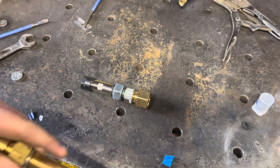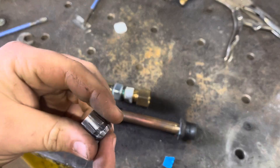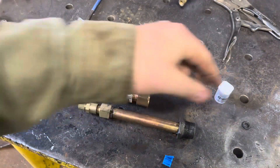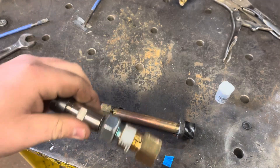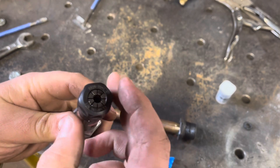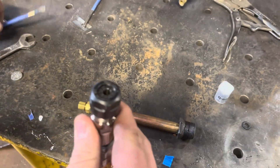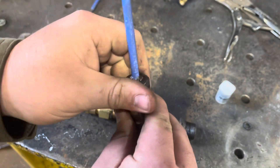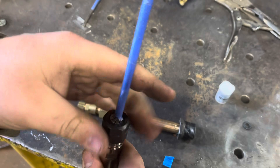On my final update I went in search of a better collet design. Looking at how manufacturers actually build theirs, they use a collet-style chuck — something like this, a half-inch collet chuck, similar to what you'd see in a die grinder. This came with a kit I'll link in. It's a quarter-inch collet and these guys slide right into the end. When you lock it down it's good and tight — you can even do it hand tight, that's fine.